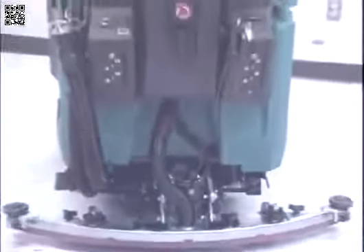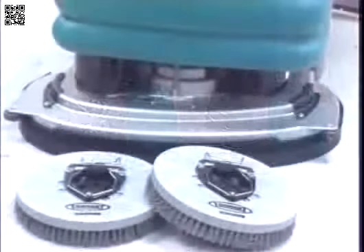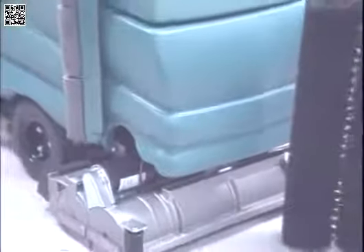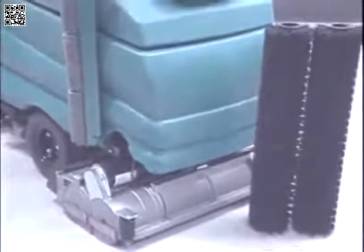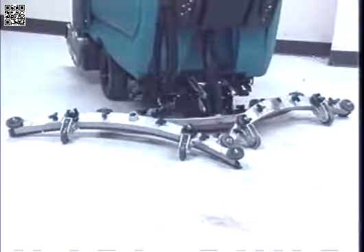The safety stop arm allows for air circulation when the batteries are being charged. The squeegee assembly is on the lower rear of the machine. This machine can be adapted to many scrubbing situations by changing the scrub head type to either the disc style or the cylindrical style head. Each scrub head type is available in three widths: 28 inch, 32 inch, and 36 inch. The squeegee assembly is also available in these three widths to allow for proper water pickup.